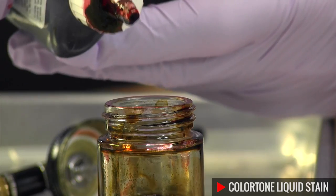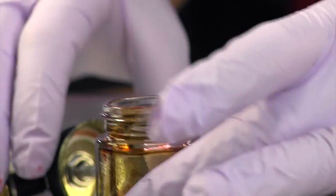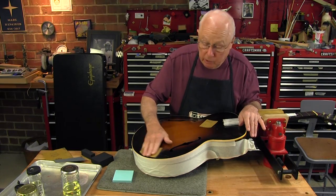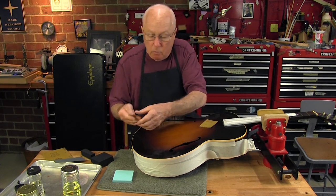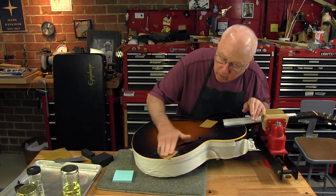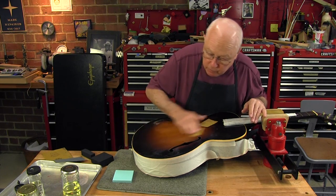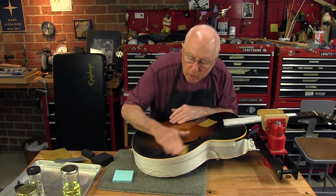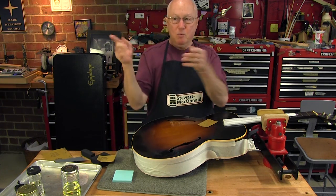It falls out of its own accord. That's to blend in with a little bit of red that's in this guitar. I've got a good buildup of clear here, but I'm not done. All I'm doing now is knocking down the dust — I don't want to get into color and any little lint or dust specks that got on there. This isn't a full level sanding, just a dust sanding. The little scratches that you may see will be gone with the next coat.